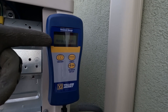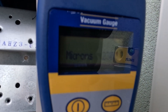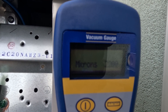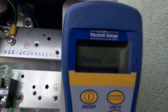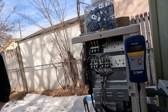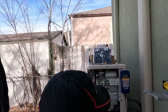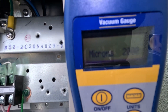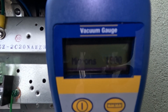Once this gets to 500 microns, we're going to let it rip. We're going to finish up this electrical, get the thermostats done, and then show you the rest. This is confirming that we're actually sucking the refrigerant down. We're sucking the air out of here, purging it — and it comes out this port on the pump.